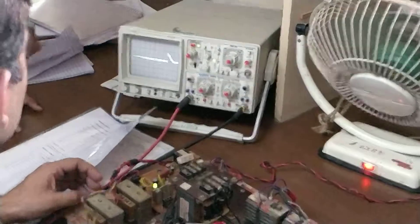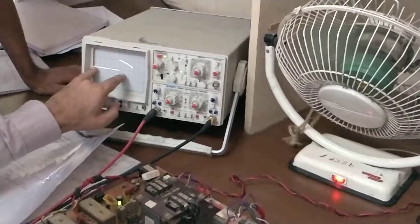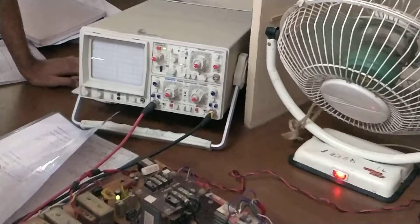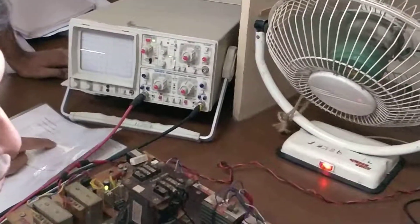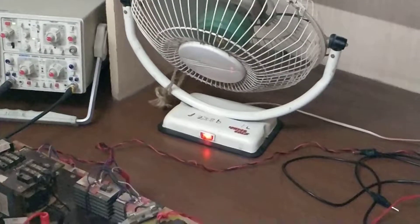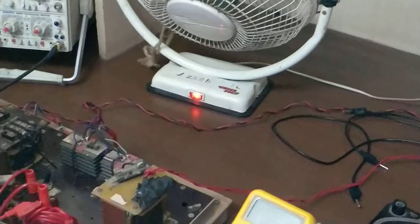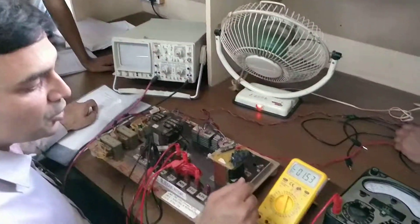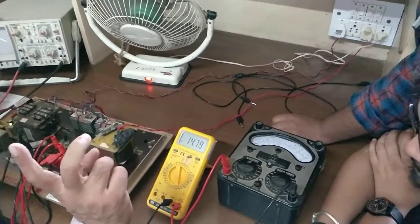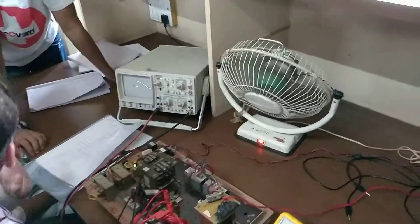I will show you one reading — the simplest one. You have passed 100 degrees, two divisions, multiply by this. So voltage V0 alpha is noted, 100 degrees noted, V0 and I0 from meters. Since this is an AC regulator, the voltmeter should be AC. So AC voltage and AC current are used.